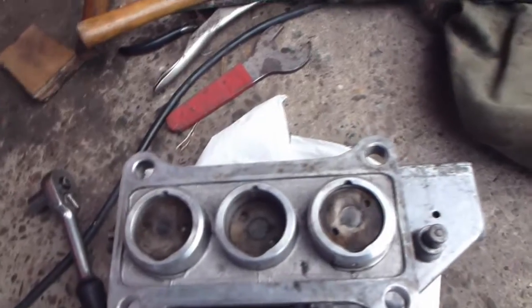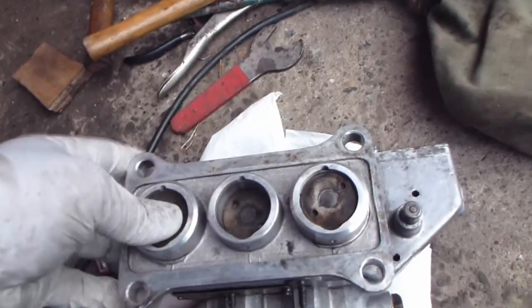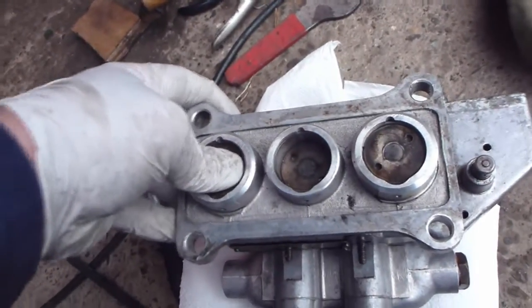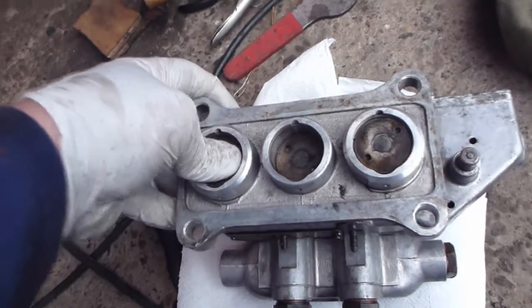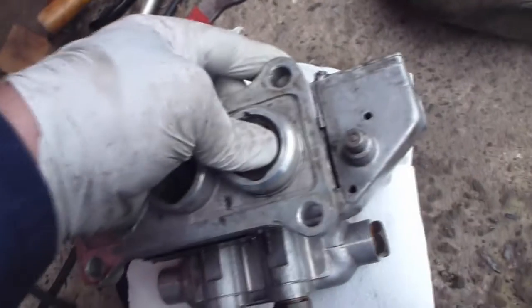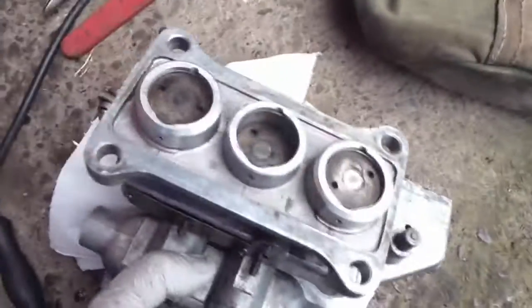With the left bank pump unit off, I think it's apparent what has happened. These tappets are spring loaded and the springs are good on this side, but in the central one there's just no springing.